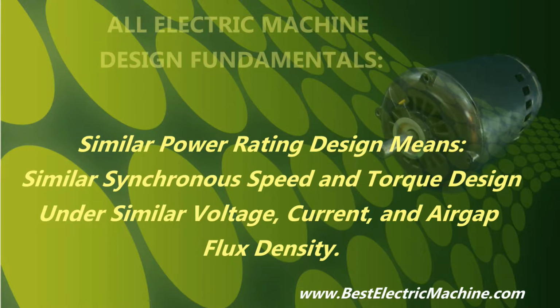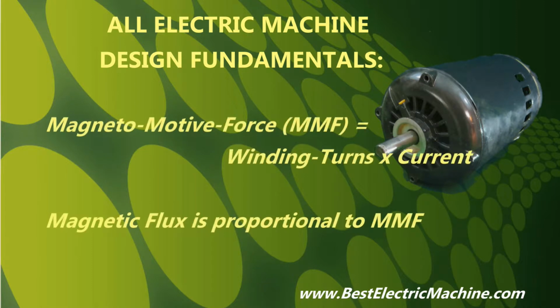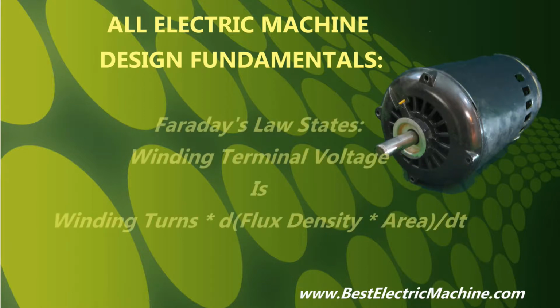Similar electric machine power rating design means similar synchronous speed and torque design under similar voltage, current, and air gap flux density. Magnetomotive force, or MMF, of a winding is the scalar product of winding current and number of winding turns, with winding magnetic flux directly proportional to MMF. In accordance with Faraday's law, the winding terminal voltage is proportional to the product of the number of winding turns